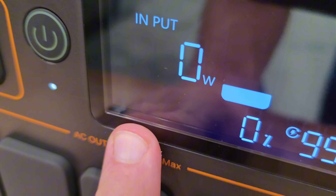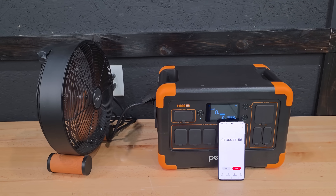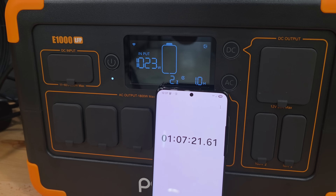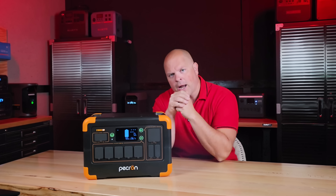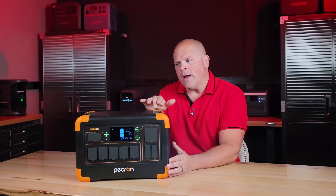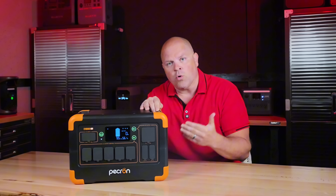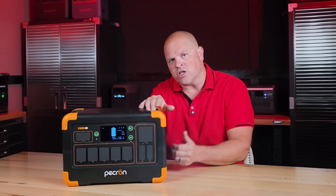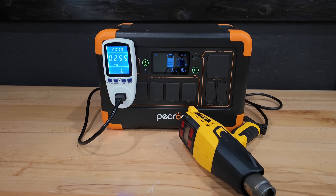That's definitely not what we want to see in a product marketed for reliability. To be clear, this was tested in a controlled environment at 72 degrees with absolutely no humidity — so it should have been able to complete the continuous discharge test, just like every other portable power station I've tested and recommend on my channel. This was unable to do that. I can imagine if you had this out in the heat, or were charging and discharging simultaneously via pass-through at 1,700 to 1,750 watts — this is going to be a disappointment.